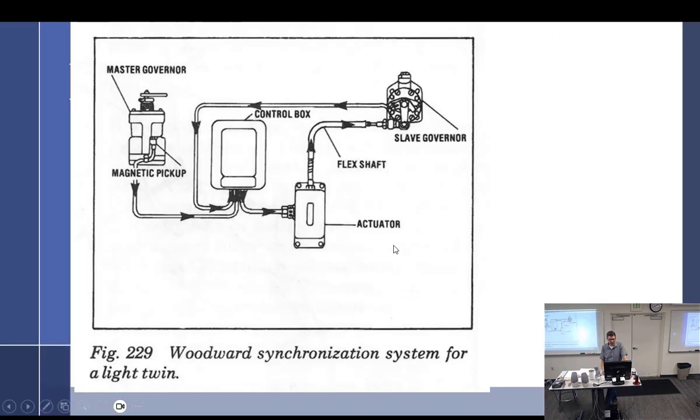All right, so what do you mean by that? So you can see by the drawing on this one, the control box sends the signal over to the actuator. The actuator's got a motor in it that's going to take a flex shaft and either push or pull on the control rod that is in parallel with the control rod in the cockpit. When you're doing that, you should see the rod in the cockpit move a little bit, like there's a little ghost right there, because it's all mechanical linkage in this particular system. Little prop control going back and forth.